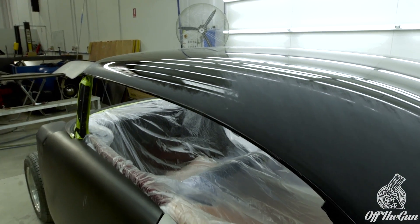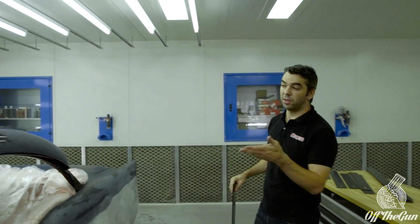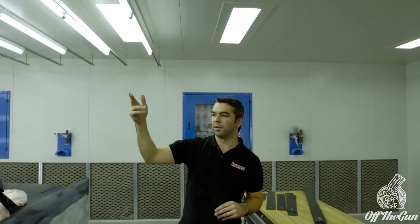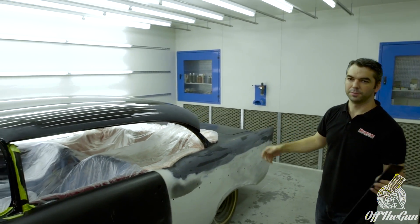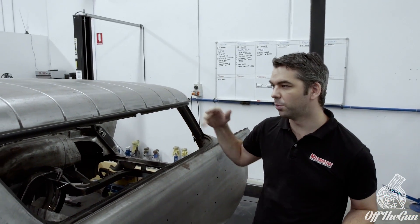Luckily here we've got these lights, which you can see in the background bouncing off the roof. In the auto design industry they're just called highlighting lights — different industries call them different things; in metal shaping they call them light lines. Ultimately, the long band of light falling over the surface tells us the surface, and the spline's doing the same thing. So here we've got this Nomad, it's still in metal stage — a really good opportunity to run over the surface, pick up any major issues and correct them before it gets sealed off.